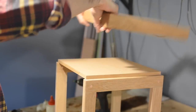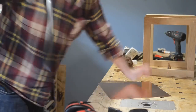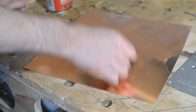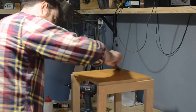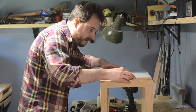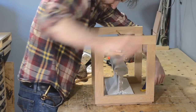I can then get the frame taken off ready for the copper to go in place. The copper I've got is 0.9mm thick — it might not sound like much but it's actually pretty rigid. I get the protective film off and then a layer of contact adhesive put on. It came with a combed spreader so that helps to get a nice even coat. I do exactly the same on the MDF and leave both pieces for around 10 minutes to get tacky, then put them together. You've got to get this right the first time as it's not going to come off again, but as it's a square bit going on a square bit it's pretty easy to line up. With it in place I get it flipped over and get my faithful bit of railway line put on to weight it down along with a few clamps.